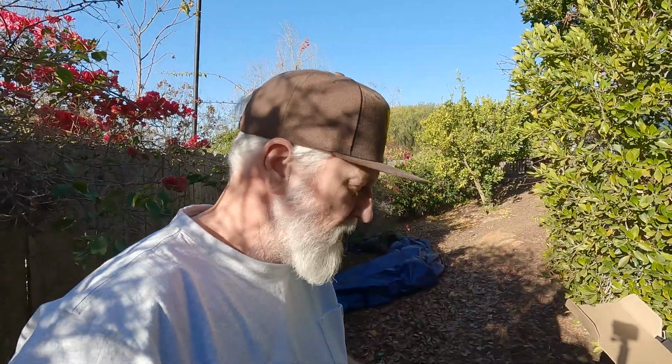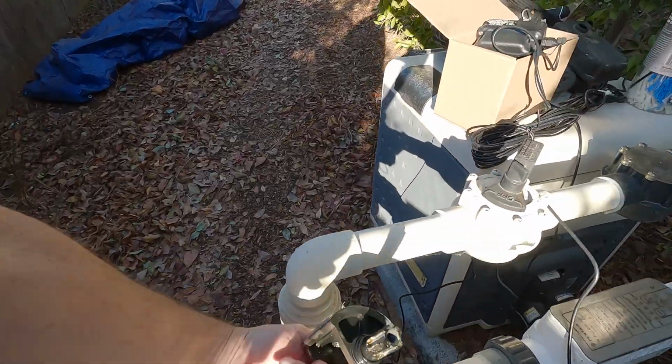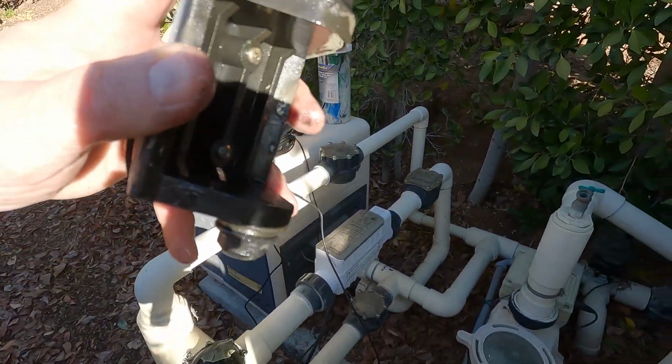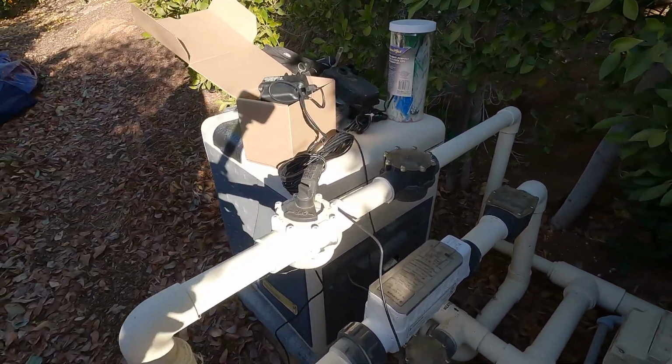Being a swimming pool fiduciary sometimes has its rigors, so I wanted to give you a proper instructional video here on how to do this process. I did this a couple of years ago, and it's one of my most popular videos. My point is that if you don't redo this, okay, this is the door that's inside the valve, okay? So I have put these 2 right here. There's 2 O-rings, and then there's a bottom O-ring, okay? Replaced all 3 of those.